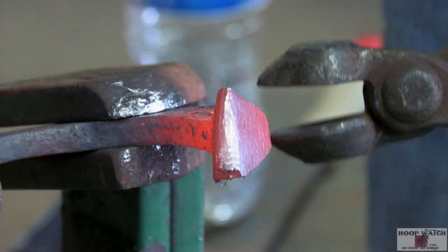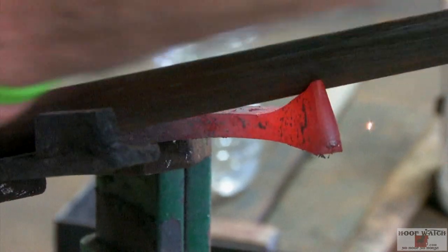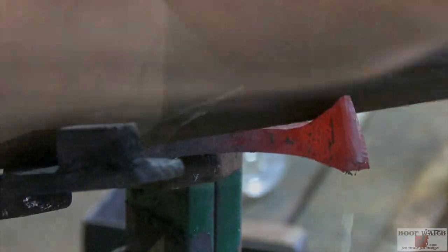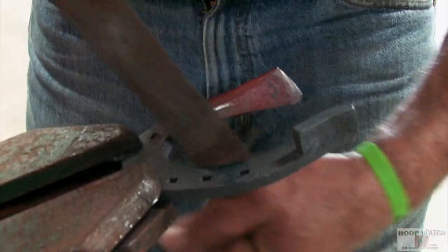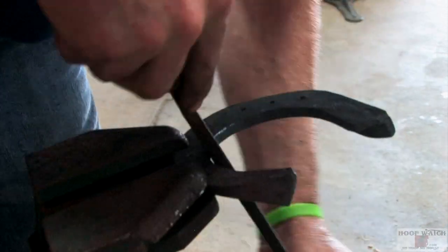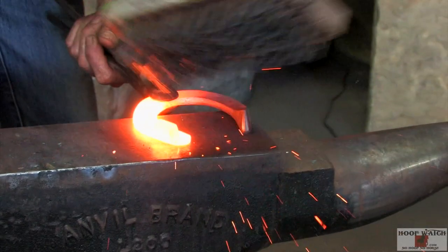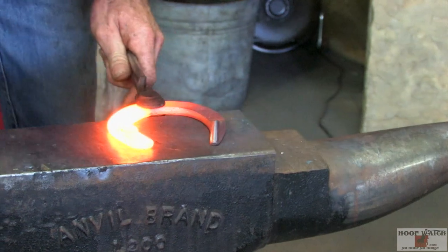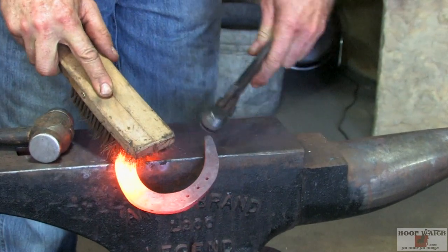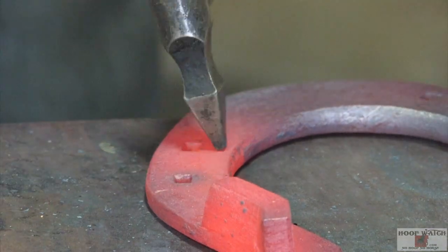I'm just gonna barely grab the toe and then just clean up my wedge a little bit. So the profile, I mean the top of my wedge, looks nice, like a nice consistent ramp. Wire brush everything up, get it nice and clean, and then we'll head stamp it for the last time and be done with it. A nicer head stamp just to push those edges out a little bit for that E3.